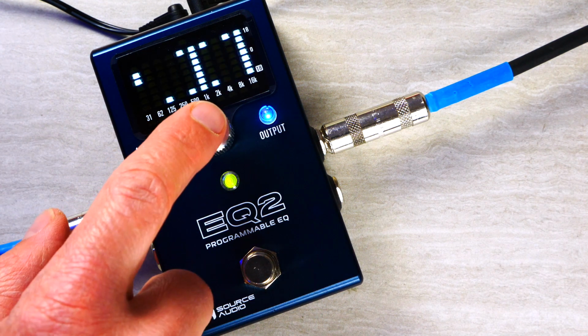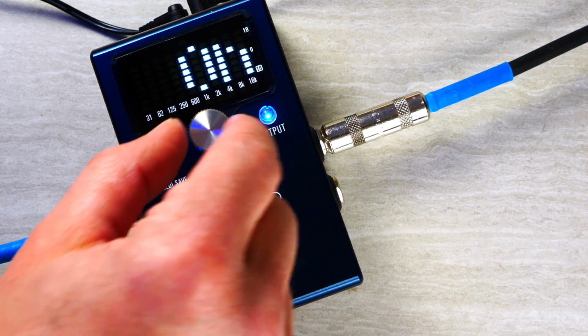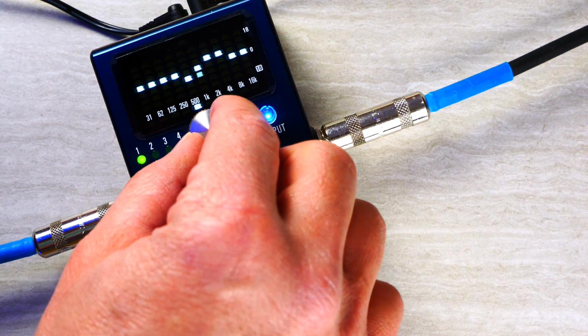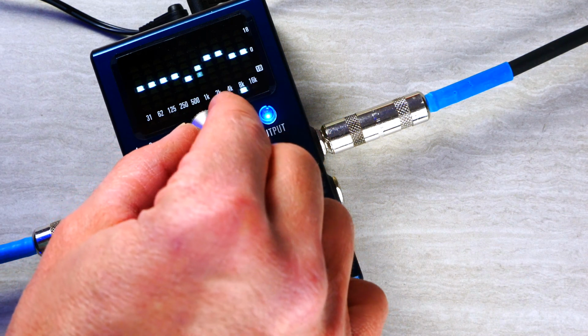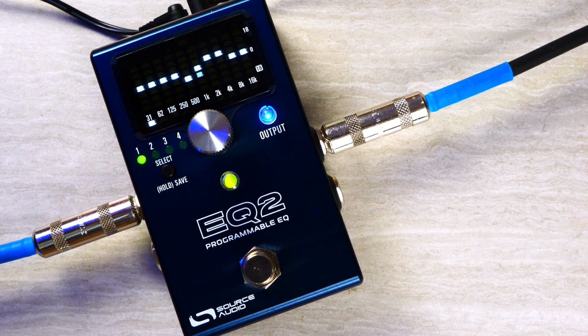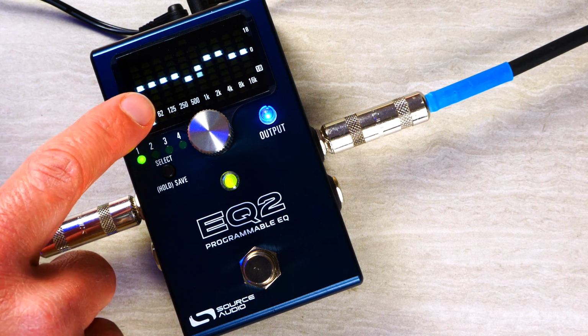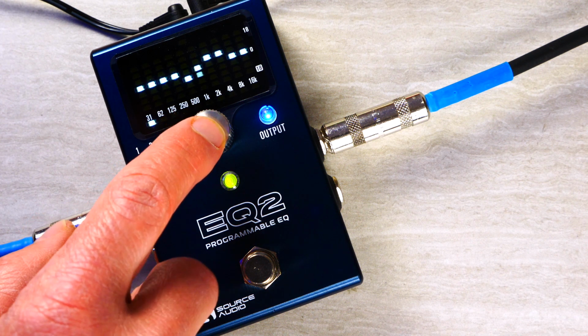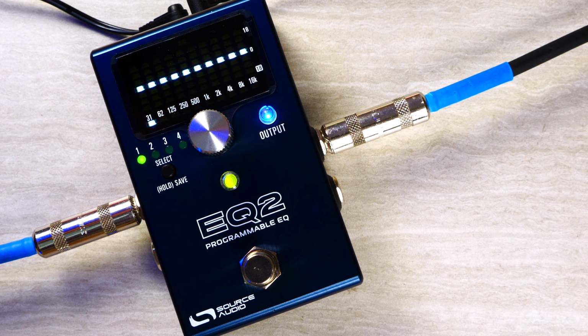Hit the knob, then select on. I'll hit the knob again and exit the edit menu. Now if I move the frequency selector all the way to the right, just beyond 16 kilohertz, resides the channel 2 settings. You'll see that because the EQ engines were locked together before, I still have the same settings in channel 2 that I had in channel 1. So I can either use these settings as my starting point, or I can do a quick double click of the center knob, and it will automatically flatten all my channel 2 settings.